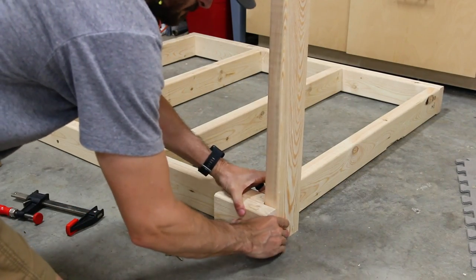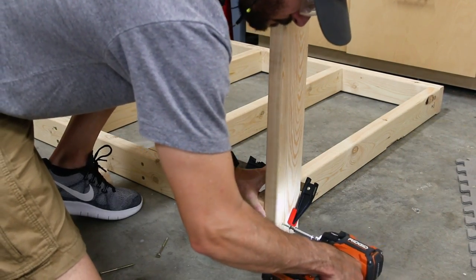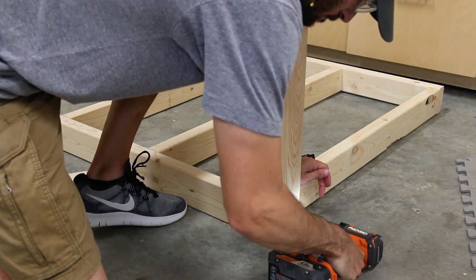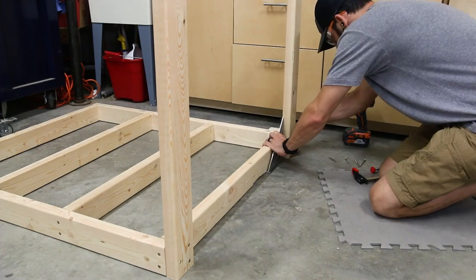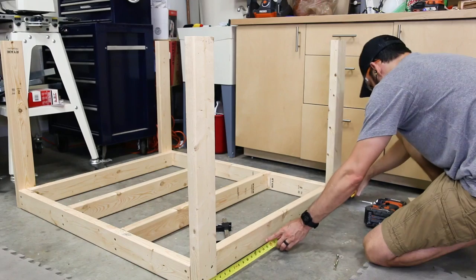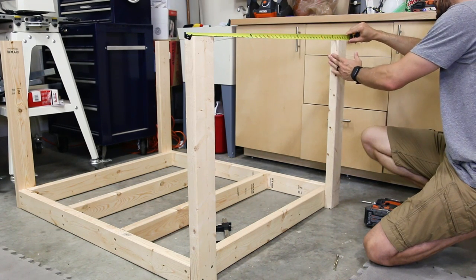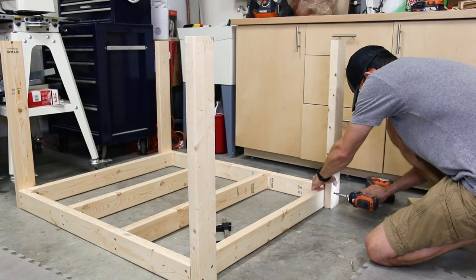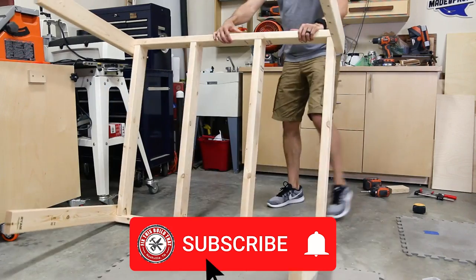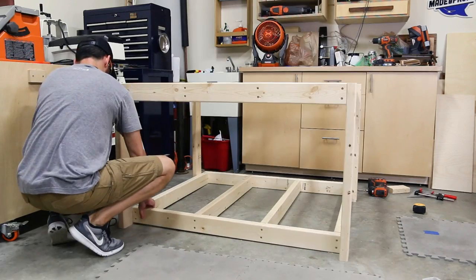To install the legs I used a scrap block to position each leg flush with the front, then clamped it in place. I checked that the leg was at 90 degrees to the floor and attached it at the screw locations. When attaching the second leg on the same side you can fine tune the angle as needed — you want the legs to be square and parallel to each other. Check that the distance between the legs at the bottom and top is the same. If you're off a little, just unscrew two screws on the leg, nudge it in place, and reseat those screws. If you enjoy seeing projects and helpful tips like these, go ahead and get subscribed — I've got plenty more projects coming.